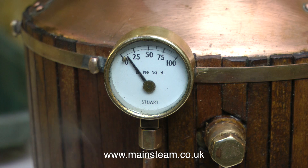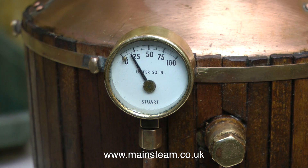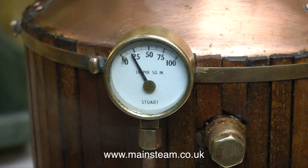The fire has a very nice incandescent appearance, and when I look at the pressure gauge, we have some pressure — the needle has lifted off the stop and there's about 10 psi in there. The steam you can see moving about in front of the pressure gauge is just coming from the clack valve below it. A clack valve is just a stainless steel ball in a housing over a hole, and until there is sufficient pressure on the steel ball to hold it firmly against the hole in the fitting, there is often some leakage — clack valves do tend to dribble at the best of times. But normally they're in a circuit with a pump which also has a ball valve, so between the two you don't get too much back pressure. As you can see on screen, the pressure is rising steadily.